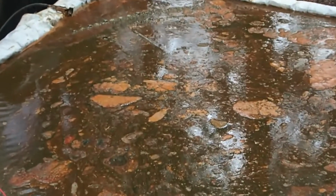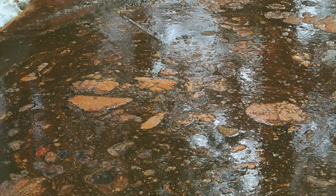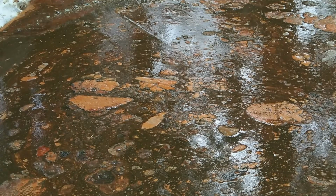But now if we zoom up, in the top left corner, you can see the bubble outline of the spoke. And it's happening on that side and not this side, just because the water's deeper over there by the lay of the land. And so the anode's a little deeper and it can reach inside. So you really got to move your anodes around so that they have a kind of frontal plane view of the part you're cleaning.